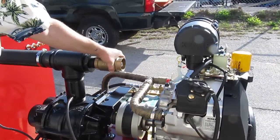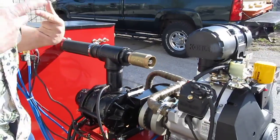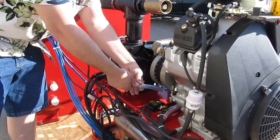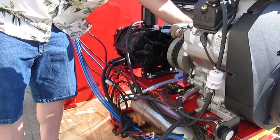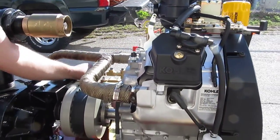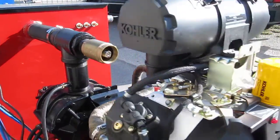This is your vacuum relief valve — that opens and closes as you put the wand on the carpet. This is for your water pump. If you want to change the oil from it, you open it up, capture the oil, close it, and you add oil right here at your water pump — the white cap — and fill it to the point on the dipstick.